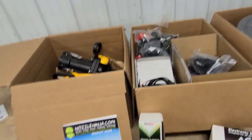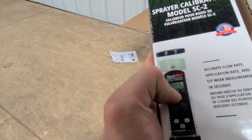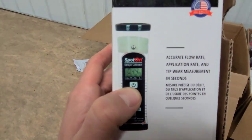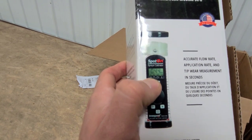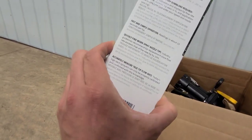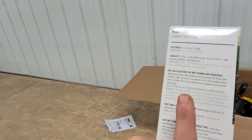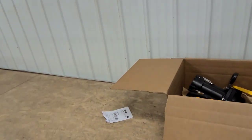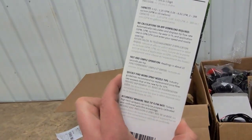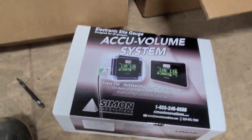This box is parts for the tender trailer — way better hookups for the hoses, so I'm gonna put those on. I also got a sprayer calibrator. You set this thing, tell it your nozzle spacing — I've got 20-inch spacing — and tell your computer to spray at ten gallons an acre or something like that, and this tells you within two percent what your equivalent gallons per minute is. It only takes about ten seconds per tip.